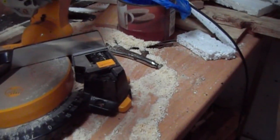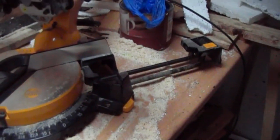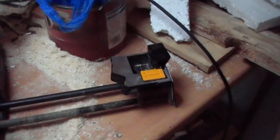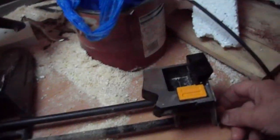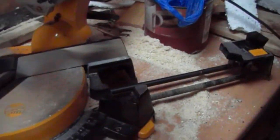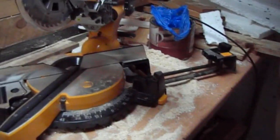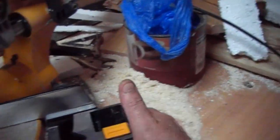On the other end we've got another holder for longer pieces of wood, and this one slides out to 18 inches. It also has a stop on the end so that you can cut a certain length of wood off. On the end here you've also got a micro adjustment so that you can adjust it to the exact point where you want the wood to be cut. It only does 18 inches, but as this is a contract saw for site work, that's all you really need. Longer pieces you'll have to make your own stop for.